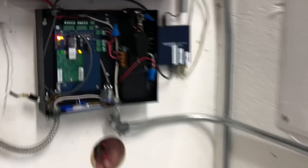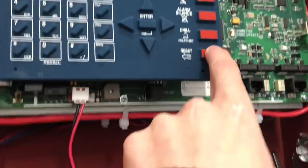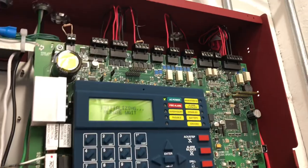I can silence the system because the door will stay like that until the system's reset. Instead of having to turn the handle, it's open — unlocked. It will stay in this position until the system's reset. I'll hit reset, and in a few moments it'll reset. There we go — back locked again. I'll reset our pull station before it goes off again.